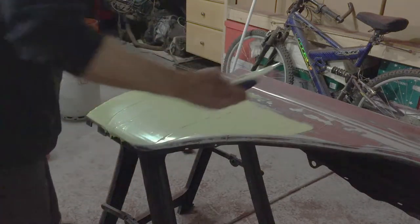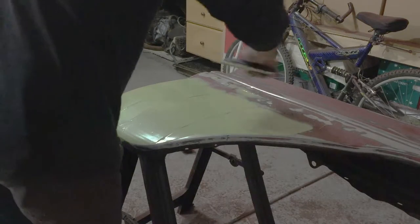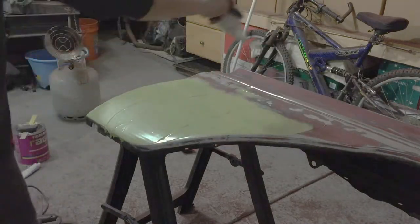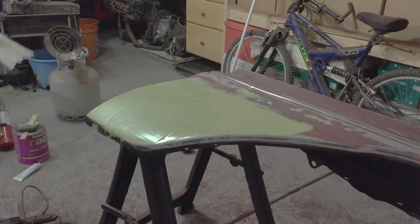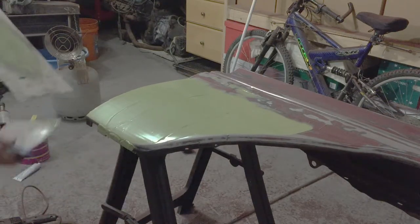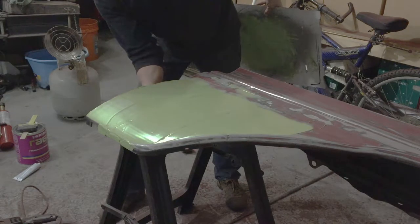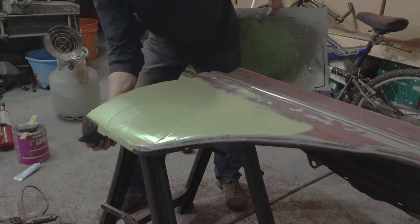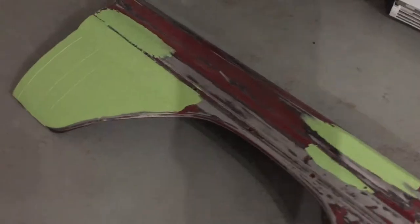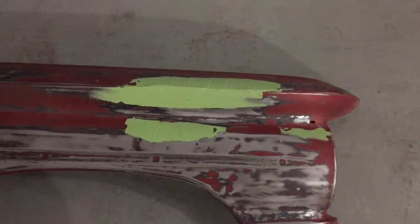For the initial coat, most likely we'll take two coats since it is pretty rough. I'll put on a first coat and this area in here is where that forklift mark was. I want to put a thin coat over all of this area too, so I might get back to the second coat and fill the rest of that area. For the first coat, this looks like it went on very well. We'll let that set and then I'll work on the next coats. I've got the filler all spread on — two coats in this area and just one coat in the area where there was just a few little dings and dents.